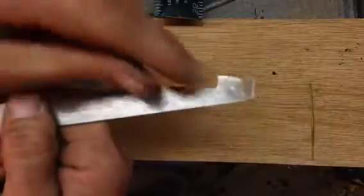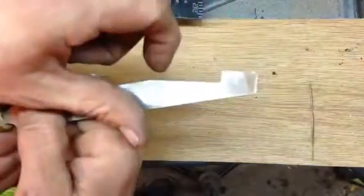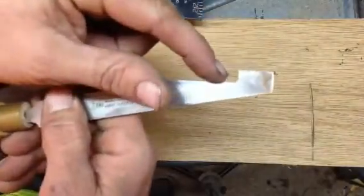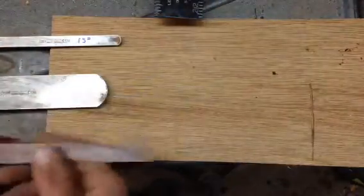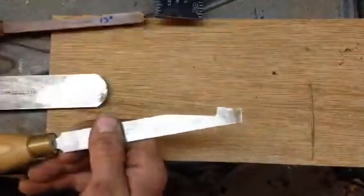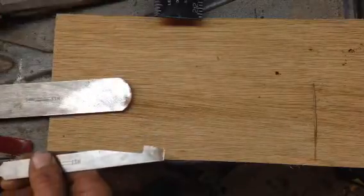The sharp edge is from the top here with a 15 degree sweep. You've got your flat and you can even go back to the outside. It helps you to shape the rim of a bowl and to finish off the end of a bowl while it's in the lathe — a very handy tool. These two are great, but the big one is really nice because the bigger the tool, the less vibration.